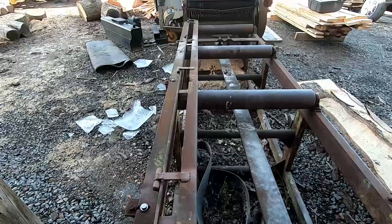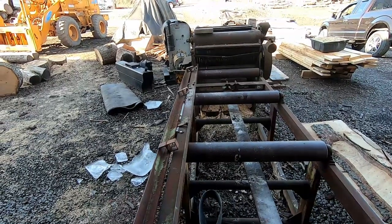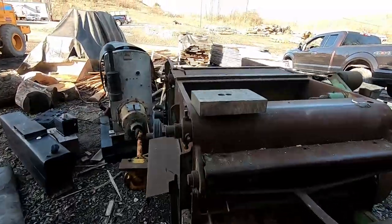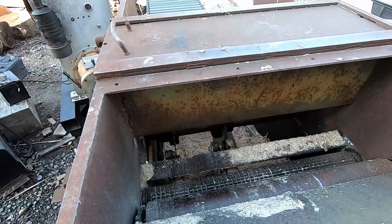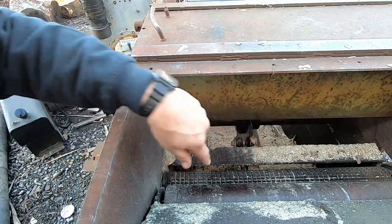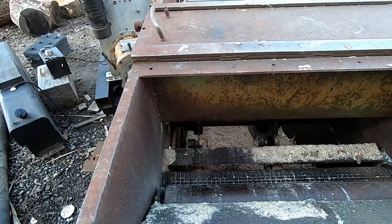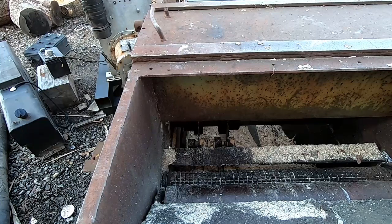I put down on for a visual. When that fence is down, it buries that second saw blade. When this fence is up, that saw blade will take up four inches off if you want to take off bark on both sides. Up in the saw itself, this saw blade right here is fixed, and this saw blade here is going to be the one to move. So I'm going to go back on the handle and take it from eight inches to a 12 inch wide board. And now it's set at 12. Now we're going to come back to our eight, go to a six inch wide board, and we can take it all the way down to a four inch board. That's the narrowest we can go on this edger.